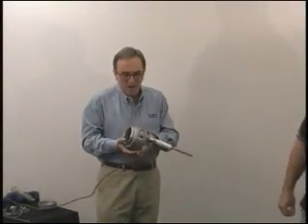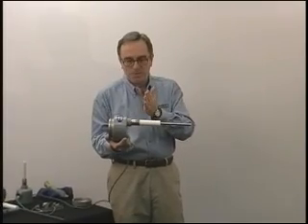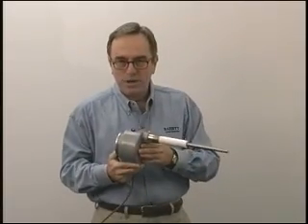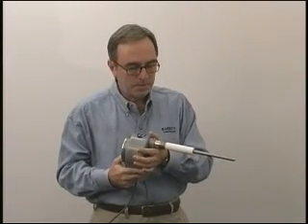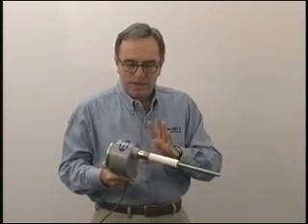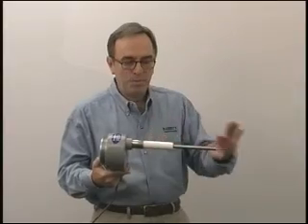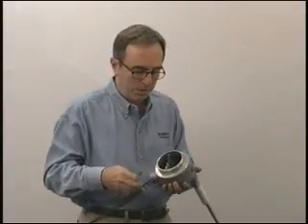This has the widest tuning range of any switch on the market. That's why these electronics will power a probe from a fraction of an inch long to over 150 feet long. By the way, this unit is a direct retrofit for a rotating paddle-type unit frequently used for dry bulk solids. It has the same exact control wiring, so it's out with the old, in with the new. There are no moving parts in the vessel, no paddles to fall off, bearings to wear out, or motors to burn up.